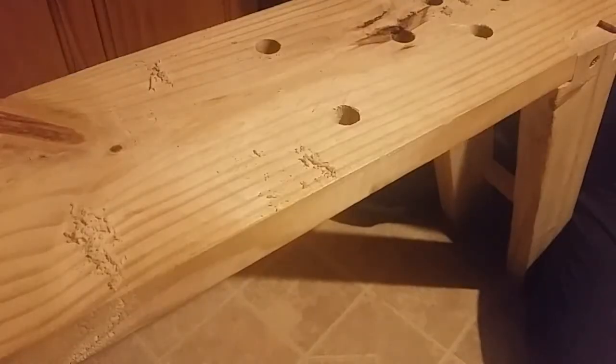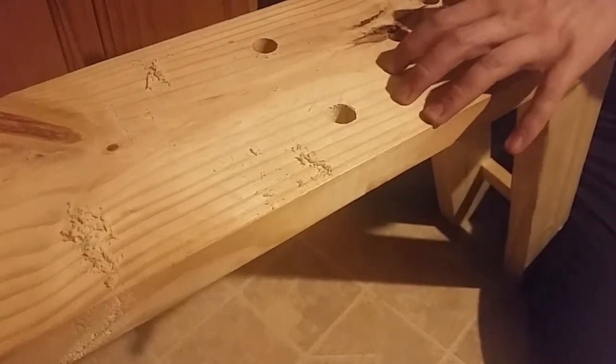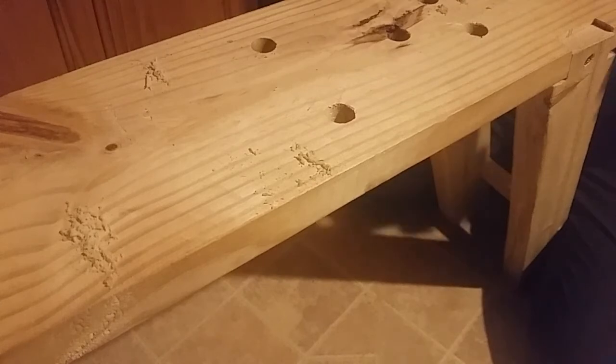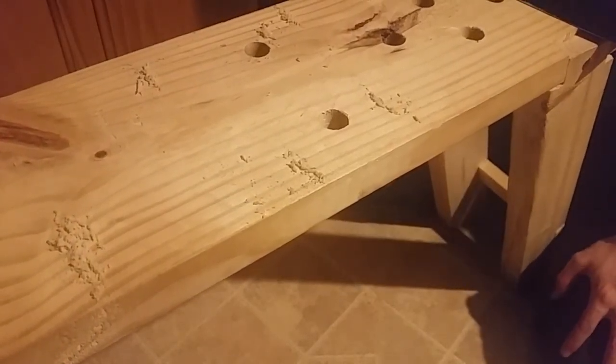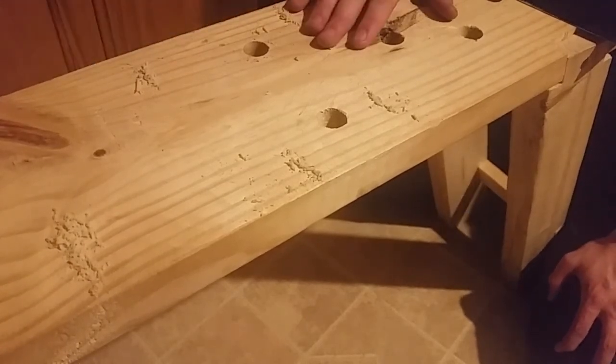If you've turned the burr correctly, then you'll be able to feel when it engages and it pulls itself to task. So you don't have to push down at all. All of your pressure should be forward. Those were several notes that I didn't hear anybody talk about in any of the other card scraper videos. So now you've got it here.